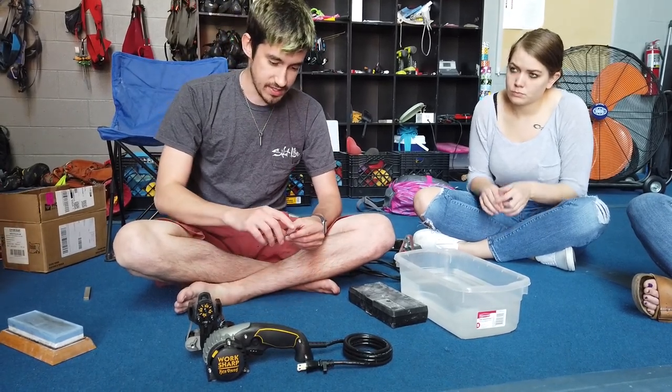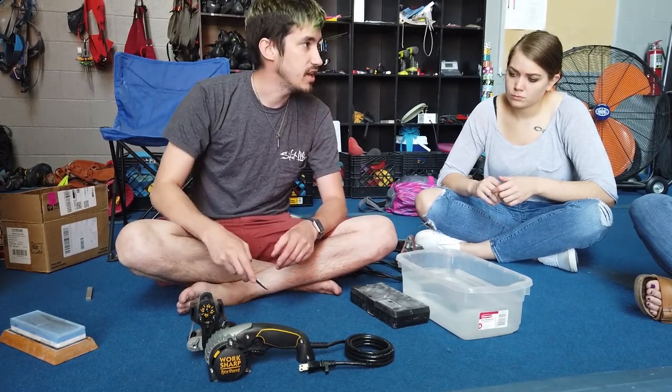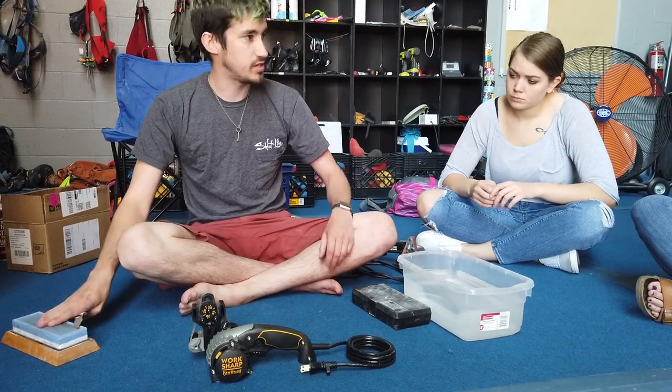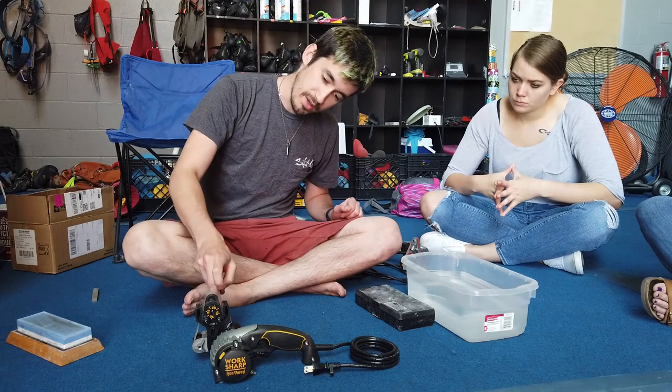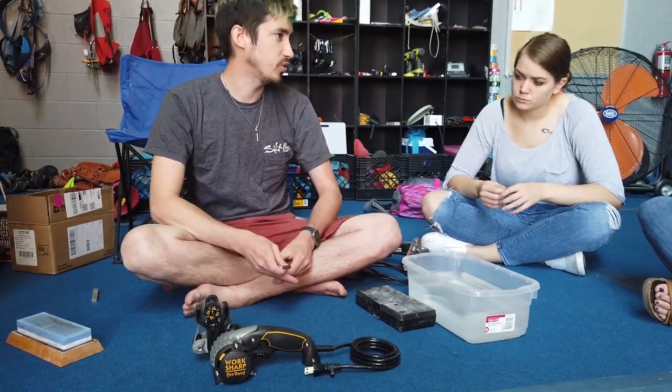The other thing I've experienced is don't let the tip come in towards the belt. If you want a very sharp tip to your blade, use a whetstone. If you bring the tip into the belt, you'll actually start getting a rounded tip and you'll never get it back.